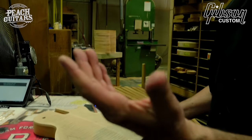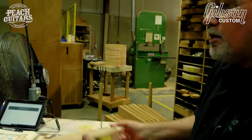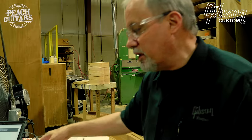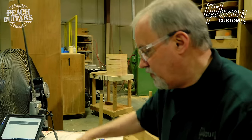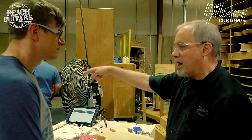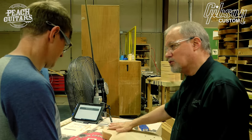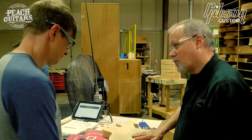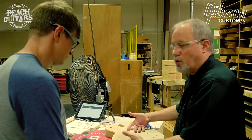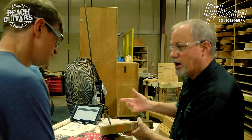So this will move on, and you can see, oh, I know what I'm looking at, and this is great to keep on your video. This is a double carve, meaning it was already carved and channel routed, then manually with the pin router they finished the other routing, they bound it, and it's in this rack to go back and now get about a 15 minute slow carving to where it's as smooth as sanding. All done by loaded-in specs from 200 or more original burst carvings. So that's why it already has binding.